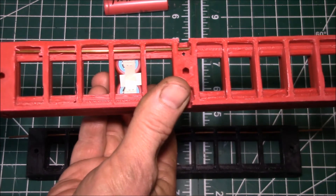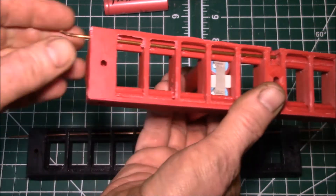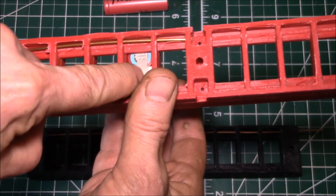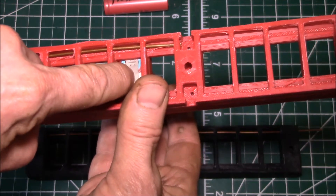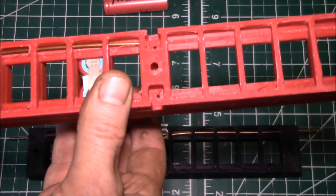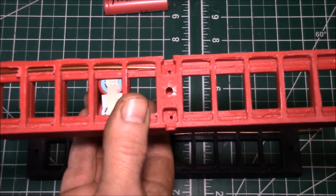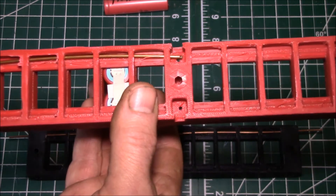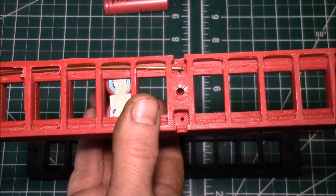The way they work, you run some sort of a bus wire down here in this channel on the positive side. You hook up your fuse wire, solder it to the middle of the tabbing there, and then up to that wire. I'll put a link to the original design video in the description.